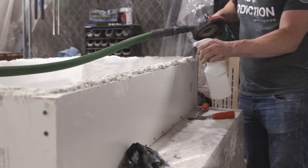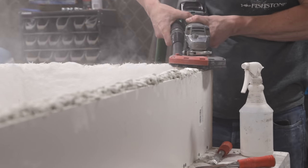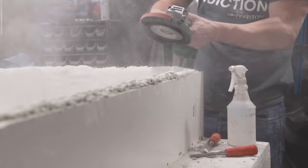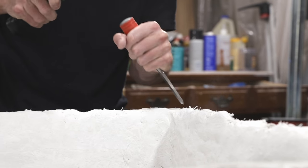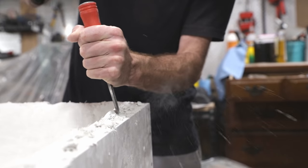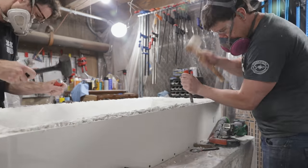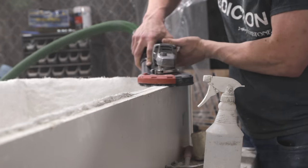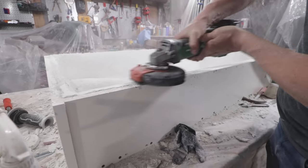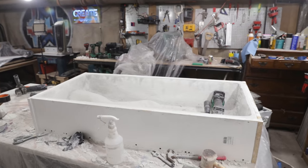Sean commented that this felt a little like being a sculptor with clay, and we'd soon find out there was more to that sculptor analogy than we realized. I usually try to scrape the excess concrete off the top edges at six to nine hours after pouring when it's semi-hard, but timing just didn't allow for it this time. I started trying to wet grind with an angle grinder but quickly realized the dust storm would blind us well before we could finish, so we took a couple chisels and started chiseling for over an hour. As we labored, we felt a bit like Michelangelo's assistants doing the grunt work. Once most of the edge was chiseled off, I could then use an angle grinder to grind the edges perfectly level with the form for a clean, crisp bottom edge to the table. We then evacuated the shop while the air filter did its work on the dust.